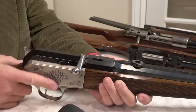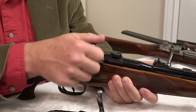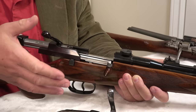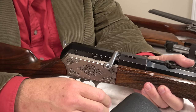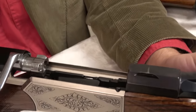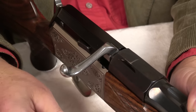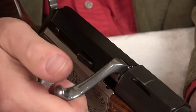Unlike the Mauser 66, this bolt handle has to lift up quite high and then go back. In order to shorten the action, they made it telescopic — this part goes into the frame of the action, then the entire bolt assembly moves backwards. The Blaser went a different route: they installed rails and also went to a three-lug bolt. The advantage of a three-lug bolt is minimal bolt lift. These lugs are unlocked, and it's one of the few actions where you can close everything with almost no effort.